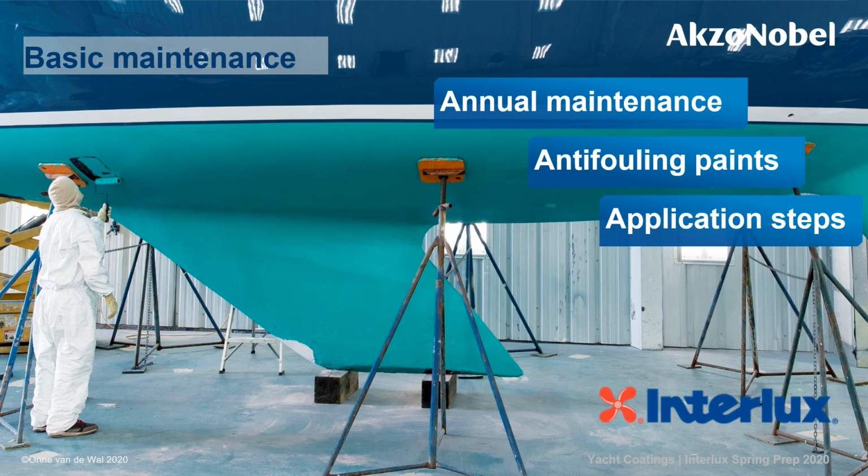Anti-fouling paints provide protection against fouling challenges like barnacles and zebra mussels. If not properly applied, you can experience fouling, which will affect the performance and potentially cause damage, as fouling could block engine or other system intakes, which could cause overheating and other issues. We will go through the different product types and what you need to do to get ready.